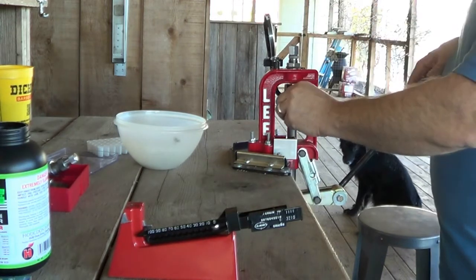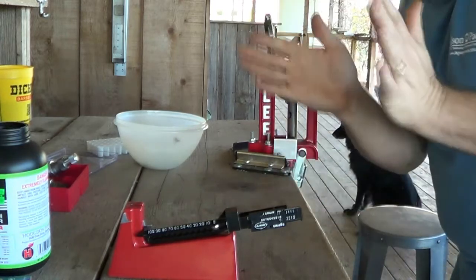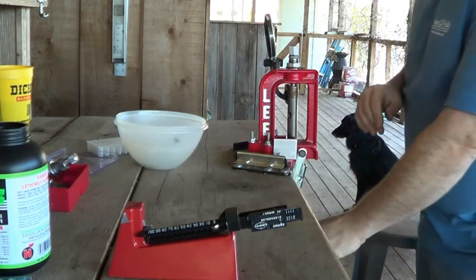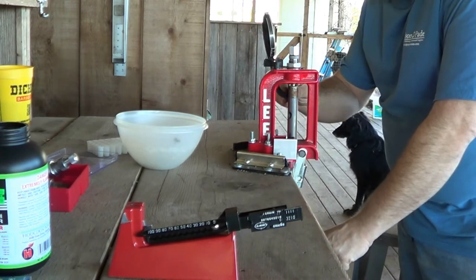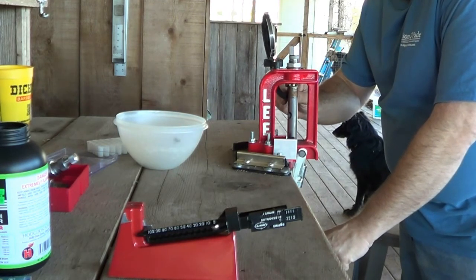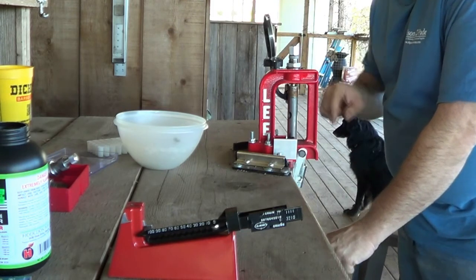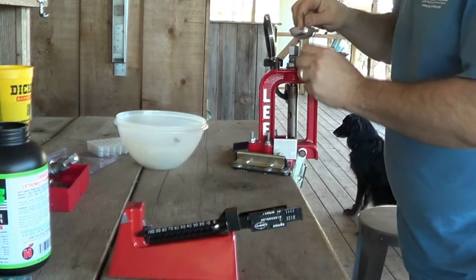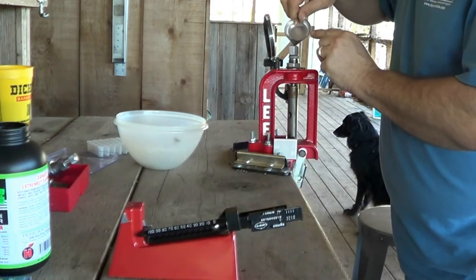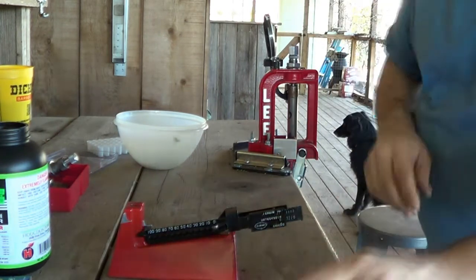We're going to put this on. We're going to raise it up. That flares it. Okay? Then I'm going to take this over in this primer thing, put it over, tap it on. I got a primer here, and I'll do a close-up so you can see it. And to make it easier on me, I'm going to take my powder, put it right through this because it's a lot easier here. Down, it's in the bullet now.